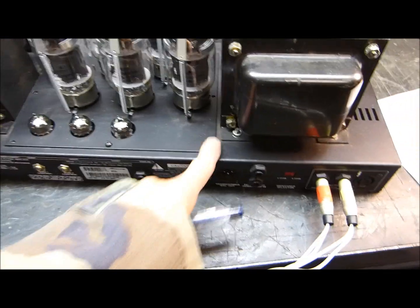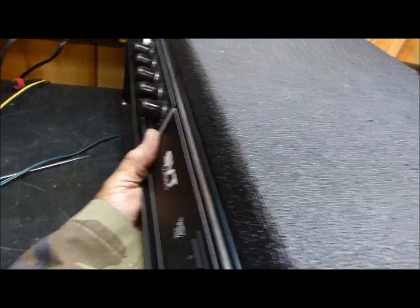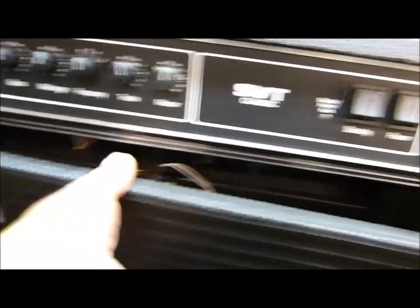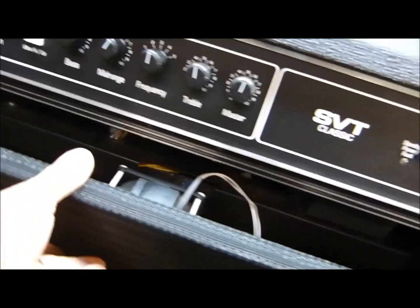It's doing exceptionally well now. I've got to show you this in case you've never taken one of these things apart — you've got to take these four screws out here at the top, this is the preamp, and then take the big screws out from the bottom. Then you've got to wrestle this thing out the back, making it crooked and cockeyed to fit — turn and twist, turn and twist. Then this panel right here just has a little Velcro pad, you plug the speaker and fan connectors in, and this thing just pops in on Velcro. Quite a chore.